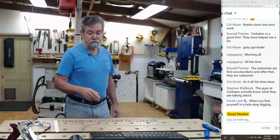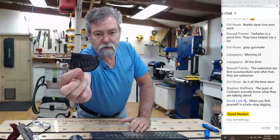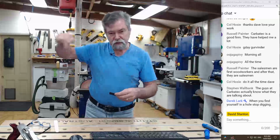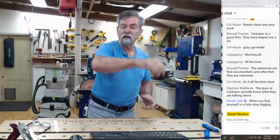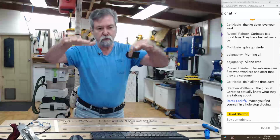I haven't really set up for this, but I'm going to do it. And I'm going to use, Steve Bruford gave me a suggestion, one of these applicators. Now this is designed for gel fix contact cement. You screed it around, it's got little prongs sticking down, and it leaves a bit and holds it up to a certain height. And then the product will flow back in, where gel fix cement stays up proud until you put it down, and then it kind of supports it as it goes down.